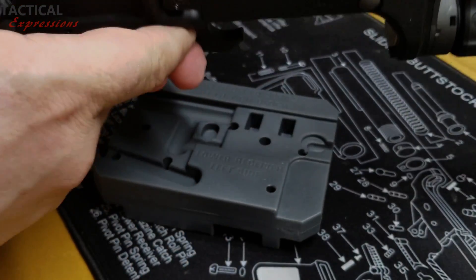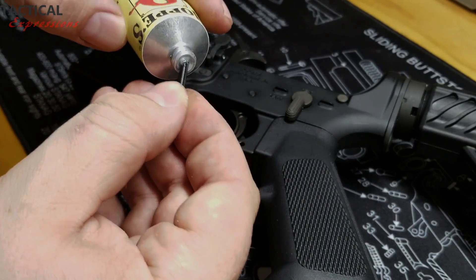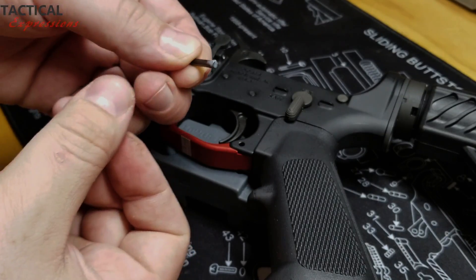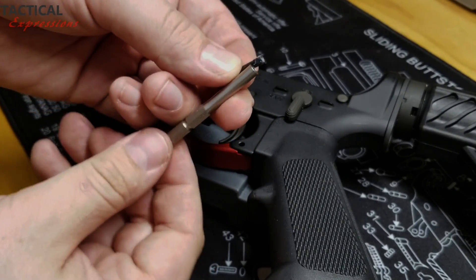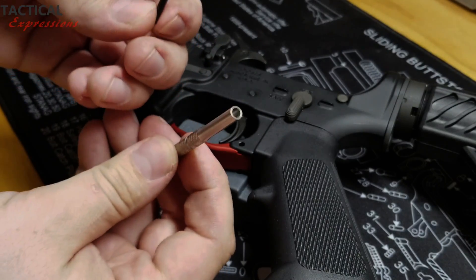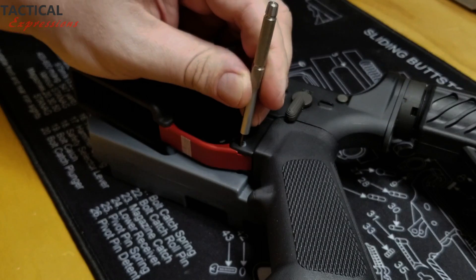Now you're ready to install the roll pin — be extremely careful while doing this. Grab your roll pin and lubricate it so it can go in easier. It's not good if it goes in dry — it can actually cause damage and it will take longer. I have a starter punch and I highly recommend getting one. Instead of using a flat punch all around, which can ruin your installation, use this starter punch. Go ahead and insert it and simply knock the new roll pin in.